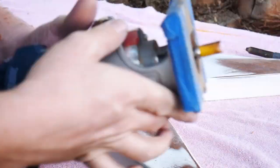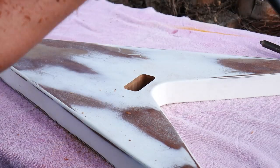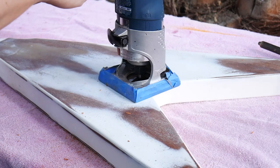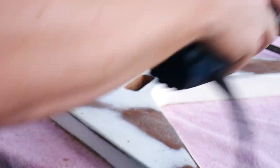Another pass down and I'm double-checking the box to make sure we're still on track — I can see it needs to go down approximately another quarter of an inch or so. Between every pass, re-measure and make sure things are lining up, because an eighth inch here and an eighth inch there add up pretty quickly. I like to double-check the measurements between each cut and each pass just to make sure we're still on track.